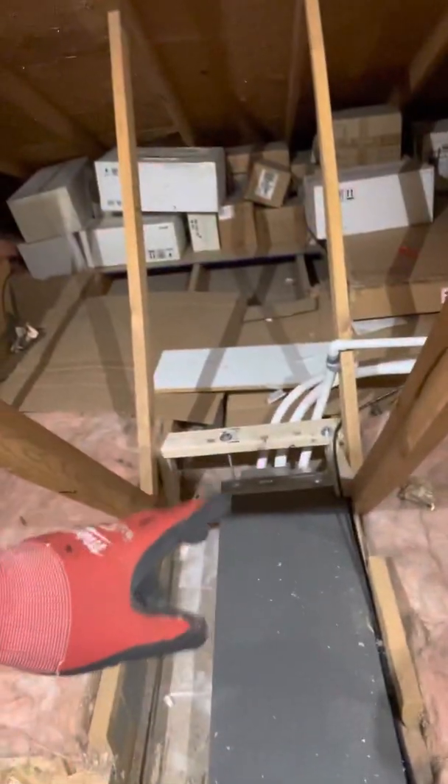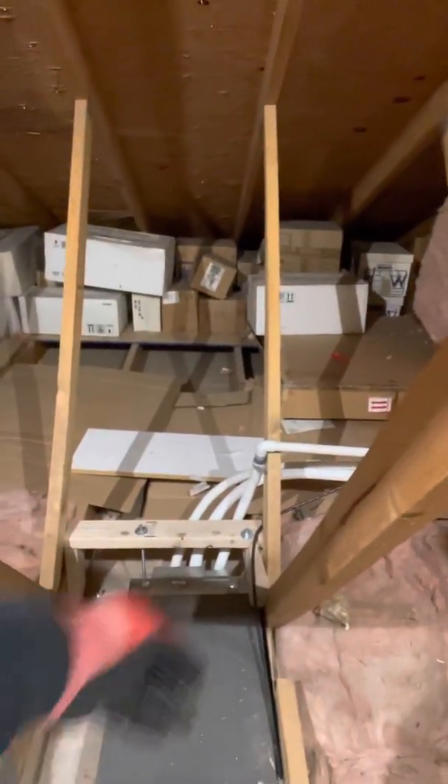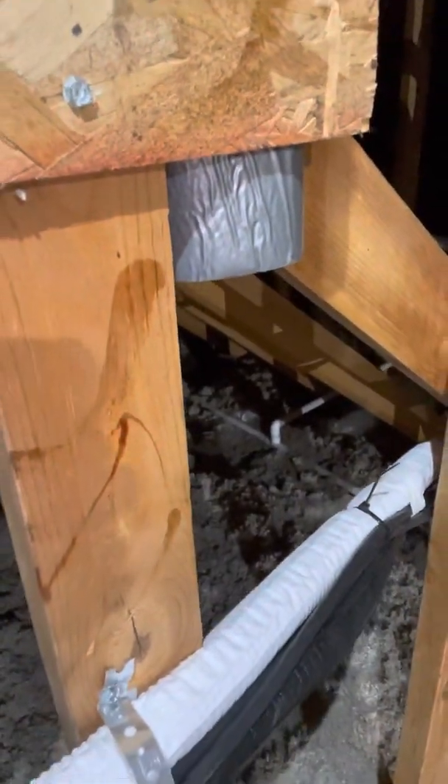One important thing is your drains. These cassettes come with a pump built into them. You can see how I have that drain line lifting up — they'll go up 19 inches from the bottom of the unit. I didn't let this one go up to its full potential. You can see how I have it going down at that point, and it comes over — we teed it in and ran all the drains from these machines. All of them are tied in. Not every single one of these is going to come on at the same time, so you don't need to run a super huge giant pipe through here. And keep in mind that they're under pressure — they're getting pumped out.